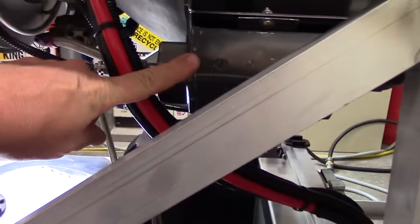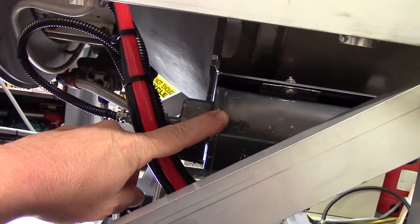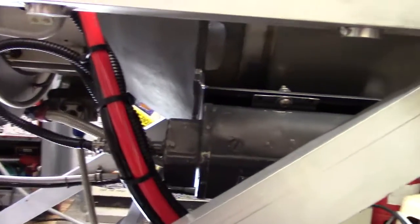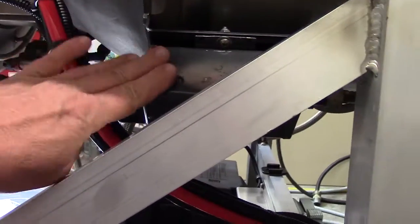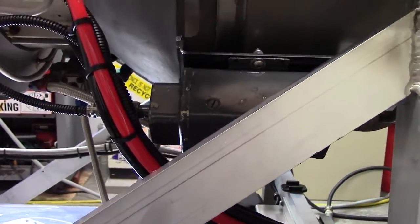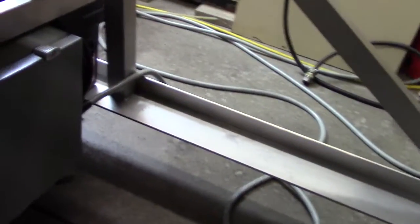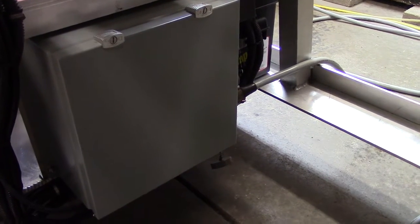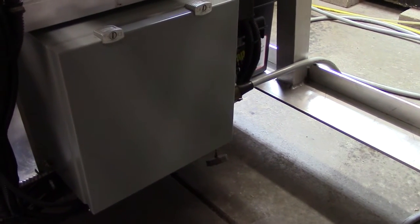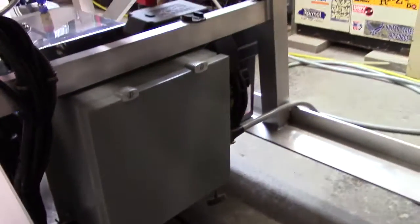My igniter box is here. We had to fabricate a bracket for that because the factory igniter box was missing — it normally attached here. I have an old reliable Bendix 28-volt DC exciter. Down here is the electrical cabinet containing relays, the starter solenoid, and terminal strips for connecting the engine functions to our control console.